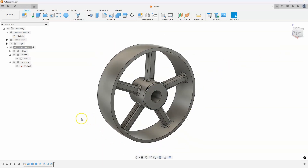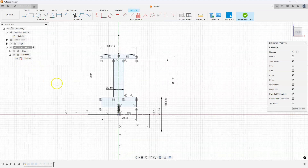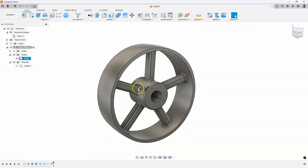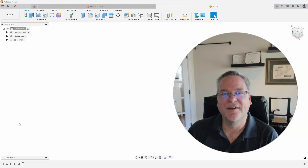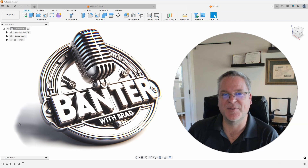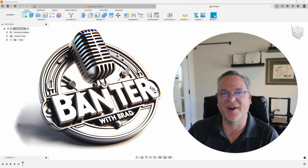All that's left according to the drawing is to chamfer these two edges at 0.06. I'll say OK and we are done with the part. The key takeaway was creating a fully constrained sketch — hopefully you learned some tips on how to do that, and how to create this model using revolve, adding the rib, extruding it to the curved surface, and patterning those features around. Thanks for watching, and please email your questions to bradtallis@nextgensolutions.com. I look forward to seeing you on the next Banter with Brad.